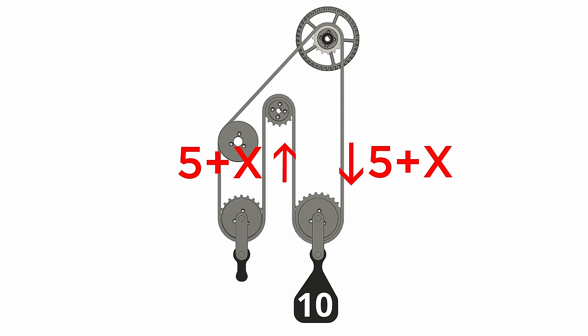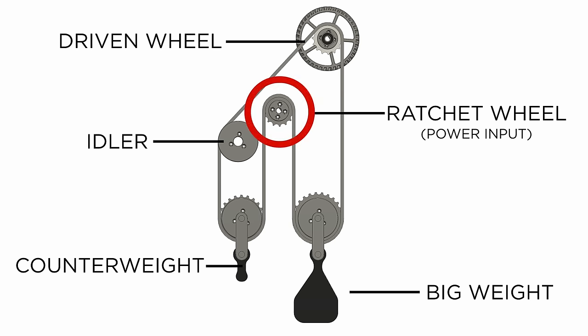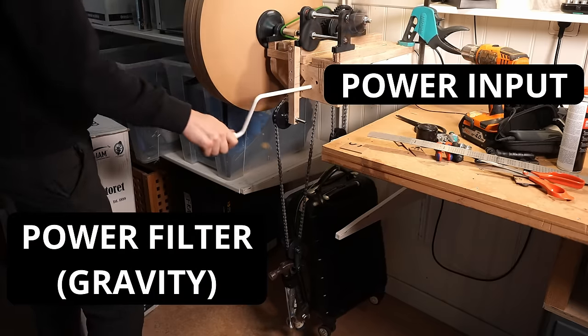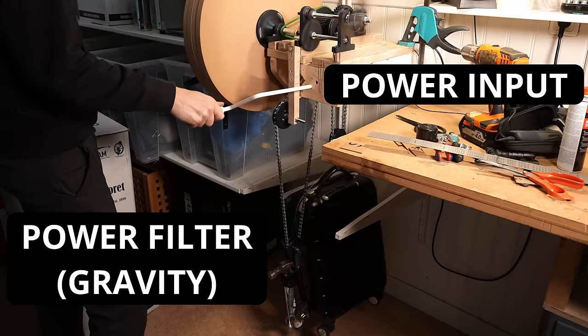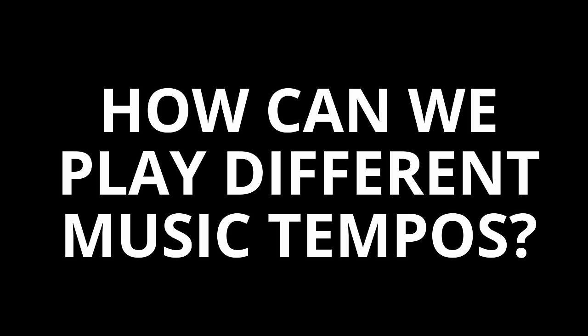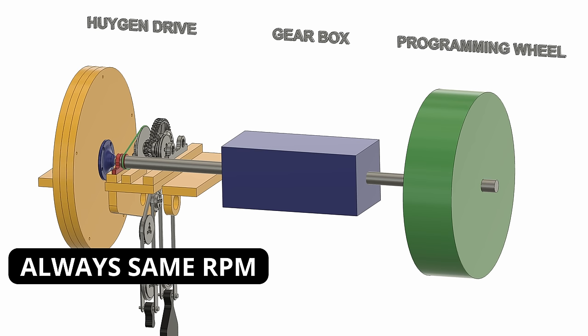To summarize: the force from the weight is not constant — it becomes heavier when we lift it. By finding the balance when it's standing still in the air, the music will be tight. It's easy to make the mistake of thinking of the weight as the force driving the machine, but it is not. It is the ratchet wheel and the force I put in manually that is the power input. The weight is only filtering my input force through gravity — we are tapping into the constant force of gravity to quantize our power input and play tight music. To play different music tempos with the Marble Machine, we will use a gearbox after the Huygens weight drive, so the Huygens drive will always rotate at the same exact speed.